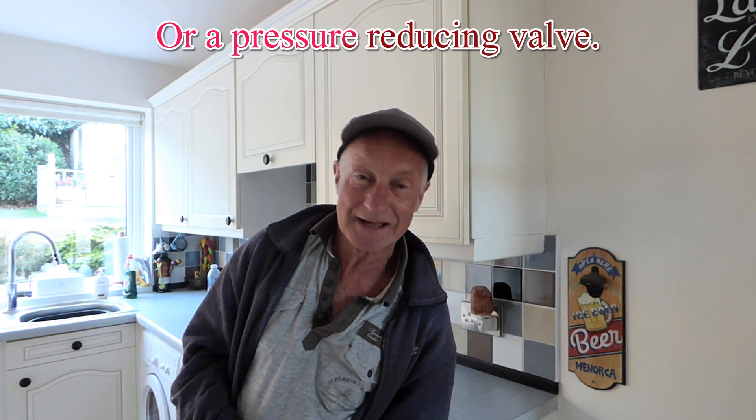Just a little experience I had the other week at a house for a lady who had problems with a tap — she couldn't quite work out why whenever the bang went off her basin tap started to dribble. So I had two jobs in one: repair the tap and sort out the water hammer. I actually sorted it just by turning the main stopcock down a little bit, without having to put a shock arrestor in. Thanks again for watching everybody — Derek, 33 for my stuff, you know where to go. Thanks, bye.